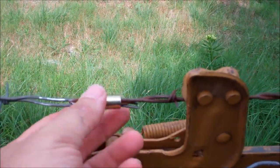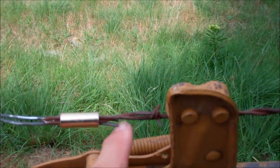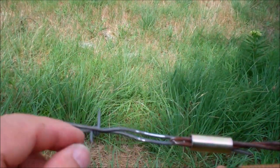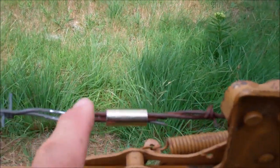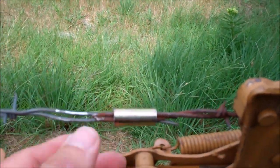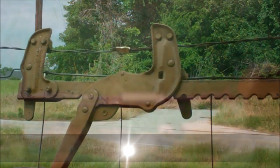I'm going to stop the camera and put it in my sleeve, and we're going to crimp that sleeve right about there. I've got the splice in between — that's the old wire sticking out that side and the new wire sticking out this side. I had to move my bar back, had to untwist the wire a little bit, move my bar back just to make it easier to put the splice on and get the two wires joined together, but that's not a big deal.